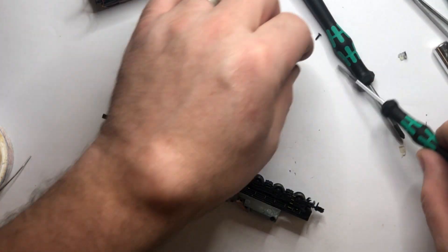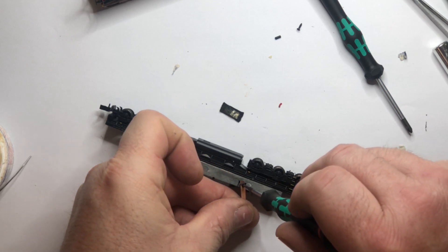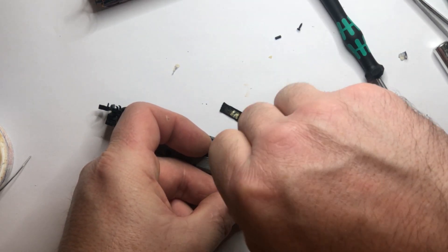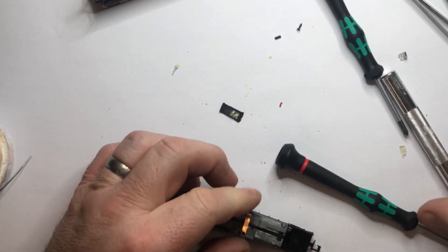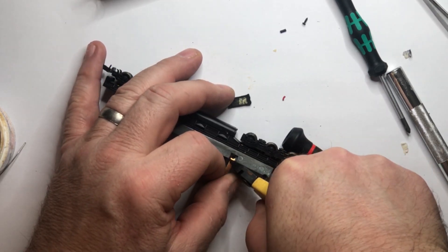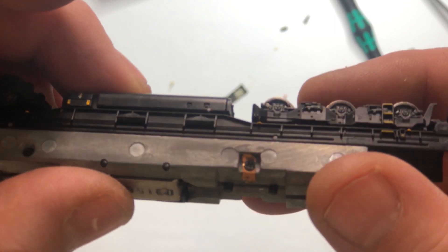What I'm going to do here is take that copper strip we used before, just thread the wire through the hole, put the screw in and screw that to the chassis - that will give me a contact point. It's a bit thicker than I thought, so out come the pliers. Tighten up the screw and you can see the copper strip - I can solder onto that. Now I'm going to do the same on the other side.